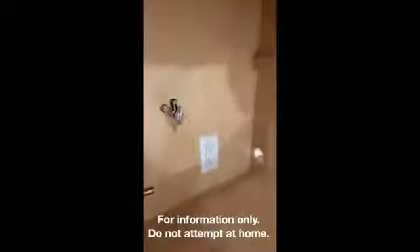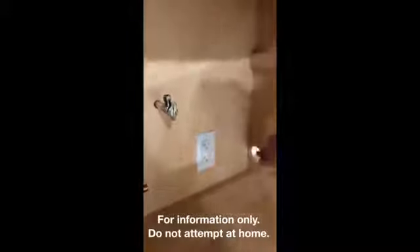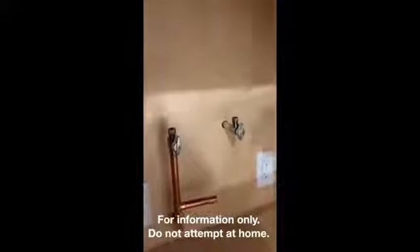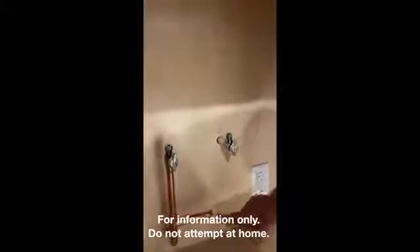You can see inside the cabinet the different piping and holes. To the right there's a big hole — that's for three things. The electric is going to come through here and plug in right here; it's got to be a dedicated line just for the dishwasher. You're also going to have a flexible drain come up here, loop around the top, and connect to the side of your drain or garbage disposal if you have one. And the other is the water line — it's going to come straight across here, with a straight shutoff valve soldered here and going right through the hole.